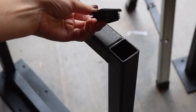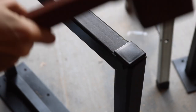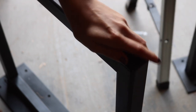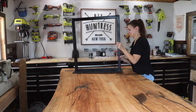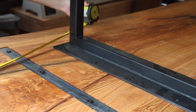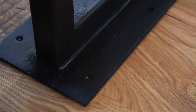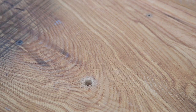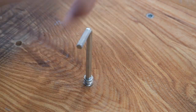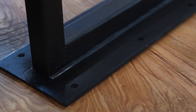Since I didn't have the equipment to cut 45-degree angles in my square tubing, my really awesome friend John Malecki, who helped me with so much of this welding project advice-wise, told me to invest in small square pegs to insert in the bottom of the tubing, and that's exactly what I did. I tapped them into place and it left little plastic rubber feet on the bottom of the base which won't scratch the floor. Once those were in place, I placed the bases in their final resting spots and marked and pre-drilled some holes for the threaded inserts. The beauty of threaded inserts is that they allow me to take the base of the table on and off as I please — which works out really well because the table with the base is actually too big to fit through the door of my parents' house, and we needed to take them off anyway to install the table.